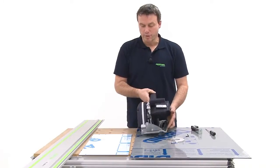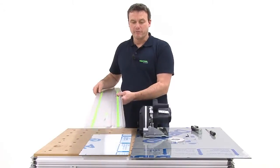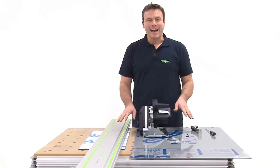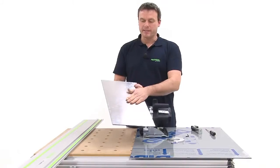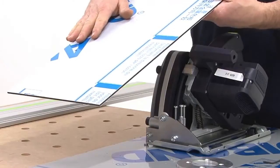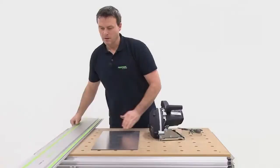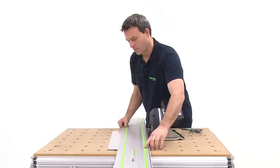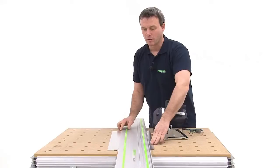The milling machine is now installed onto our guide rail, which we already know from the videos on the handheld circular saw and the Festool router. Materials always have two sides — side A and side B. In this case, side B will be grooved. Side A is usually already painted and covered with protective foil. The guide rail is put on top, and I can find my position by checking the cut indicator.